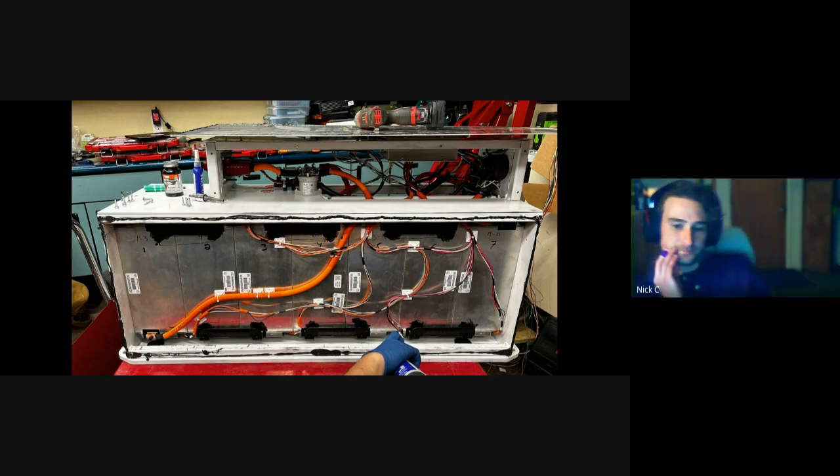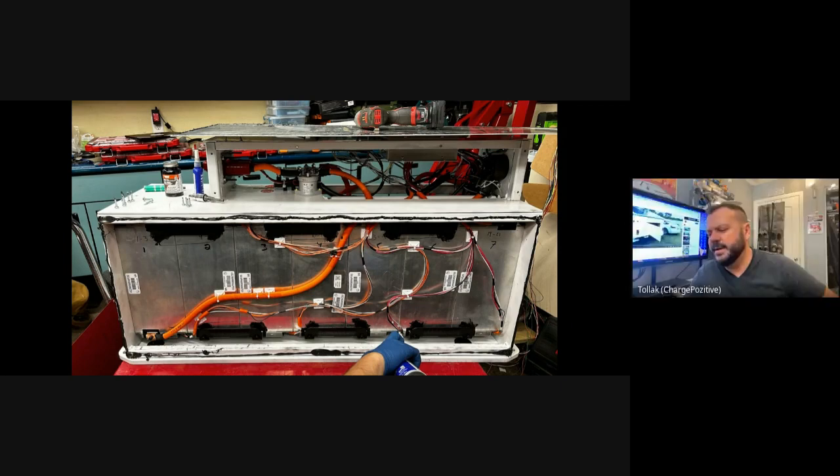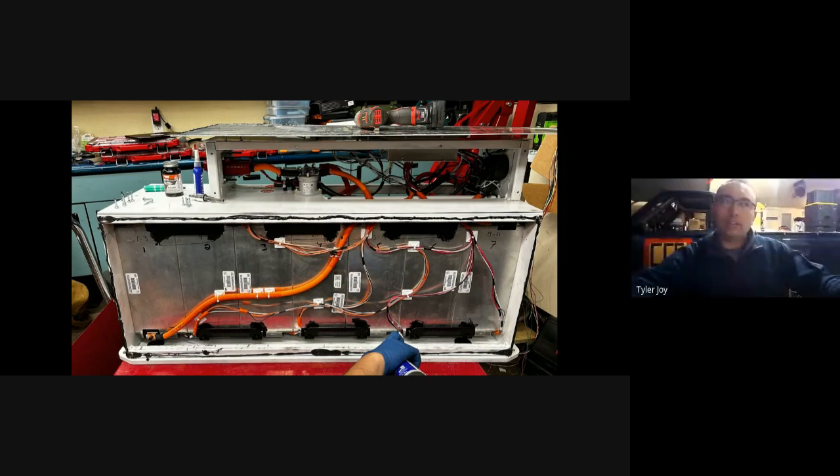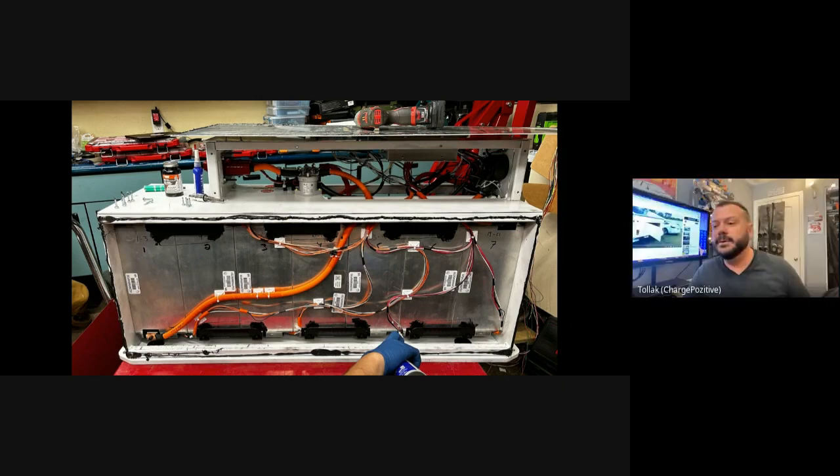So how much is 8? Is that 20 kilowatt? I did some math and it looks like 38 kilowatt. Is that what you're doing? More or less, like 40 amp times 4 times 240. Yes, but it's 2 separate chargers, so about 18, 19, I think. Yeah, because we're charging 2 batteries at each point in time, right, Tyler? So it's half the charging each.